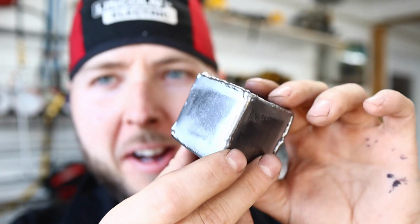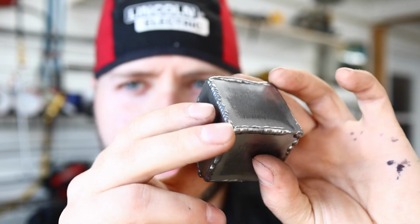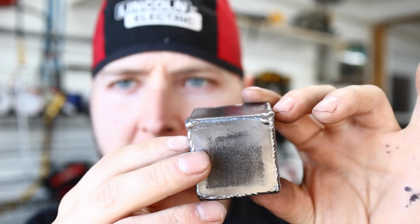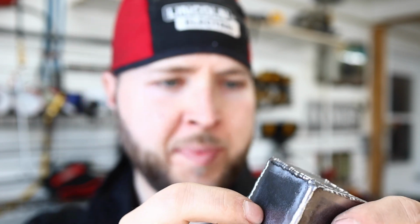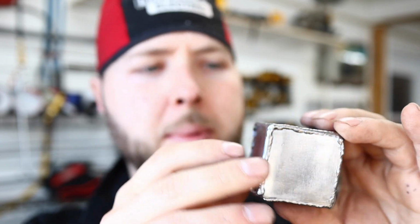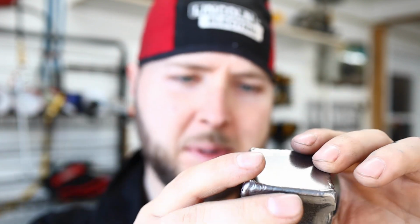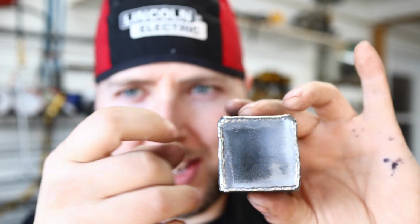There you go, it doesn't get any more honest than that. No grinding, nothing. All I did was clean up the oxides on there on the wire wheel. That right there is my best one today. The 3/32 electrode that I switched to right at the end there did well. And if I had switched to the 3/32 filler rod as well, this would have looked probably a fair bit nicer, a bit cleaner, nice solidified dabs, but I can't figure out those 1/16ths yet. But there it is, in all its honesty. We got to practice today.